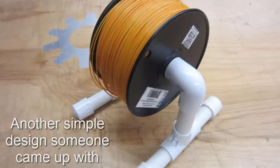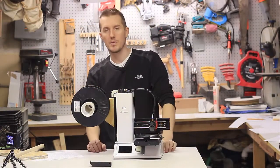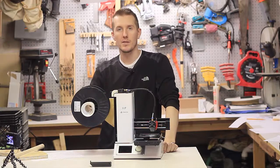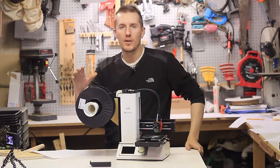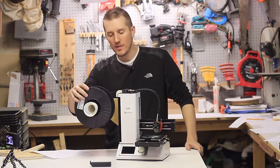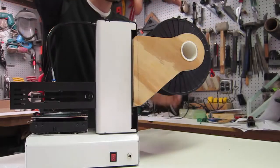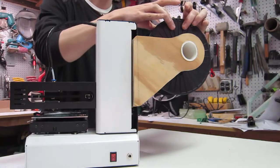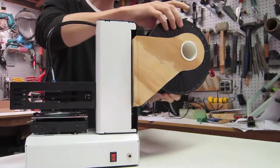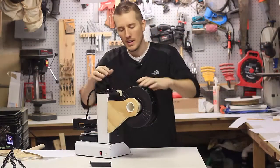It's easy to get on and off, and it doesn't take up that much more space. If you're tight for space, you could keep it or put a PVC pipe at 90 degrees. The important things to know for your printer: this feeds in from the side, so you have to know the distance the spool has to be away — you want a little bit of a gap, not super tight. Most rolls are eight inches in diameter, three inches wide, with about a two and a quarter inch diameter hole in the middle, which is why two inch PVC is a good fit.